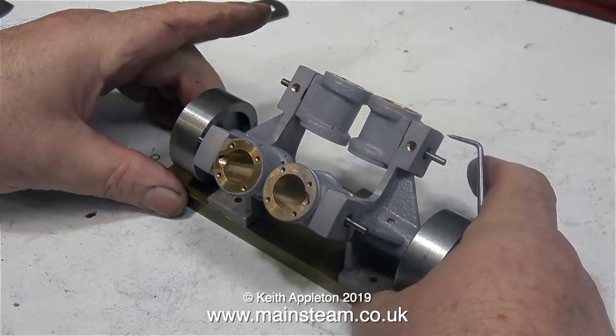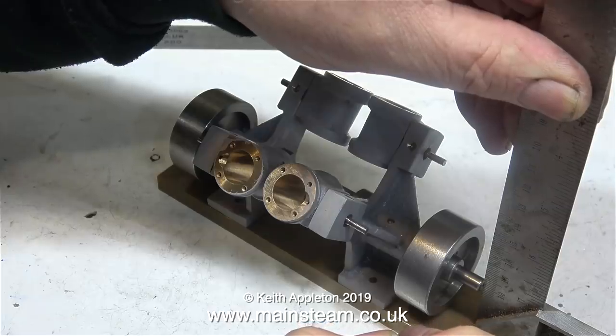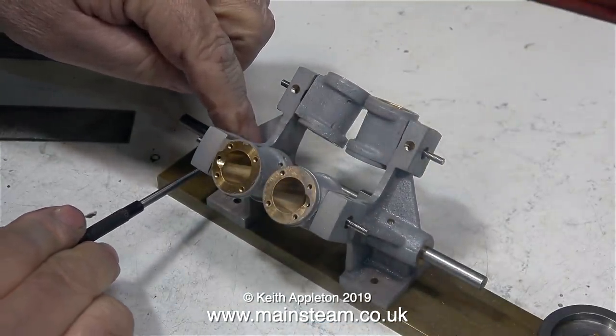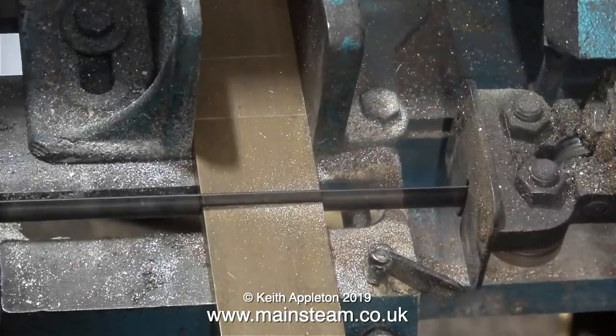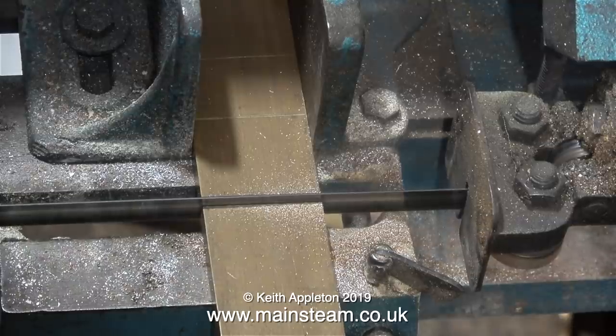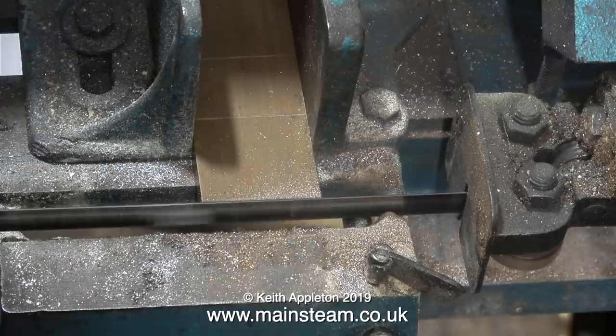I had to wait until the paint dried, and now it's dried I can mount the engine to the brass base. I used a set square to arrive at the distance between the two ends of the crankshafts, then I made some light scratch marks on the brass just in case I got confused, and then I used my metal cutting band saw to cut it to the correct size.